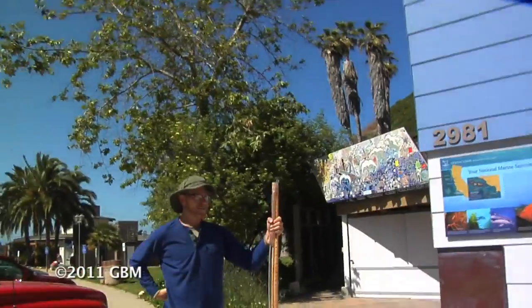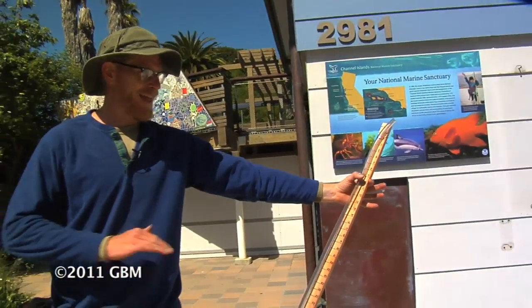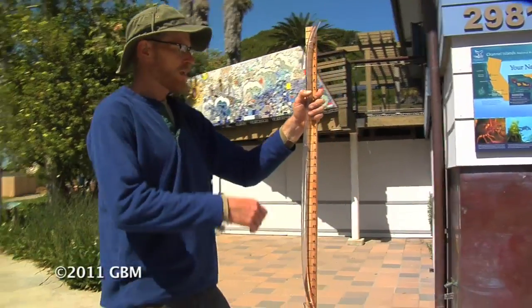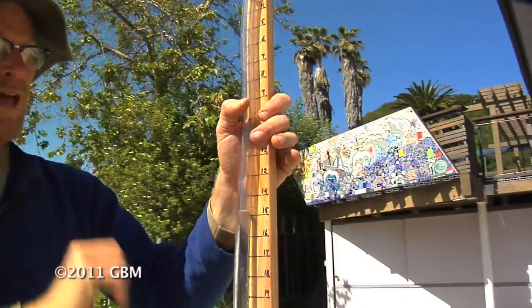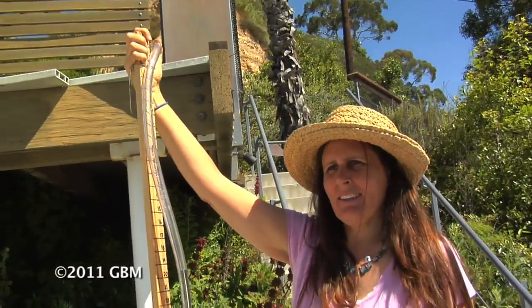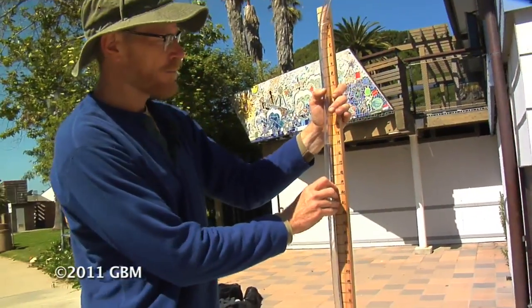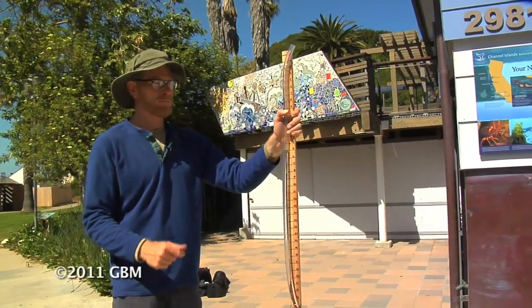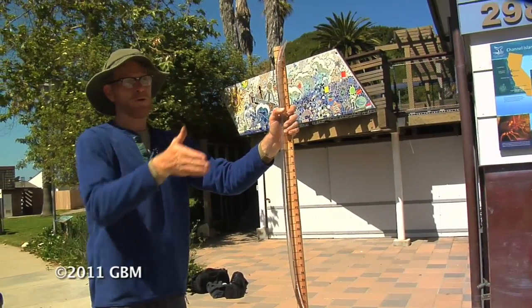Here's a key thing — I sometimes have a bad back and I don't want to get lazy. Instead of bending over and reading it like that, which will give me a bad reading, I always want the stake to be vertical. Now it's vertical. I'll tap this slightly to reduce that effect. Now it's stopped and I read 15. Jill, what do you read on your stake? 20. So it's a difference of 5 inches. Since Jill reads the higher number, she is higher in the landscape. I am 5 inches lower than Jill, and I know the slope is this way.